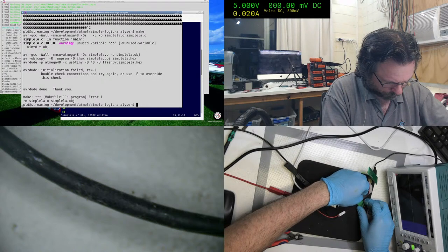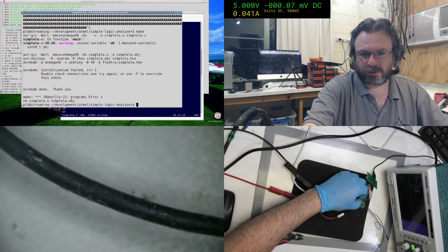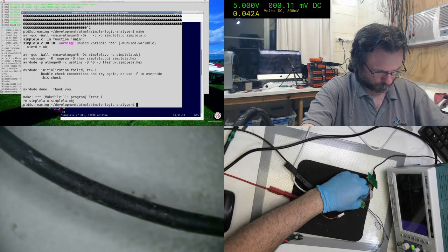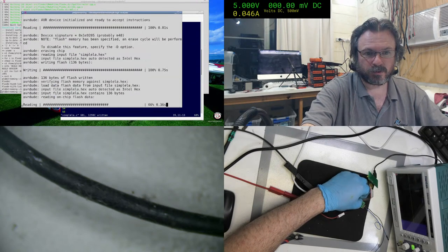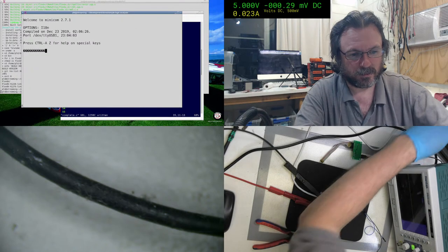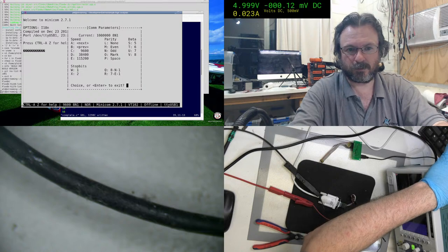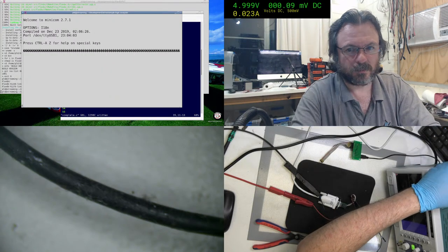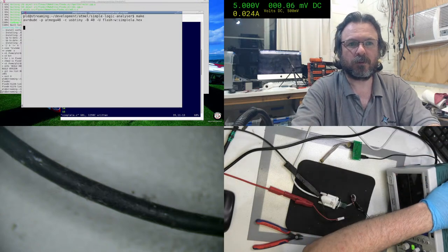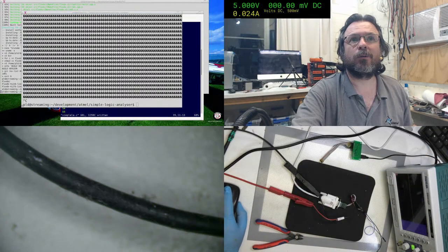I could probably do it if I don't bother with the bridge chip, and if I just simply go straight, you can get the FT232s and things like that, that just simply take logic level and straight into USB. That's what we will actually be wanting, because the slowdown is likely in trying to make the voltage swing have enough energy in those caps. Yeah, it's not coping with it. No. Alright. Back to boring old 38400. That's a shame.